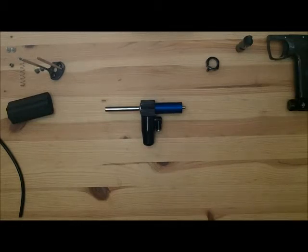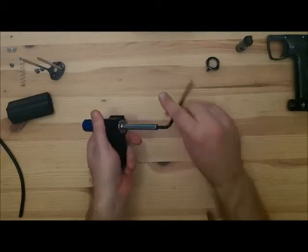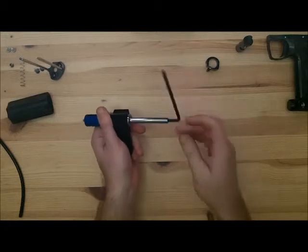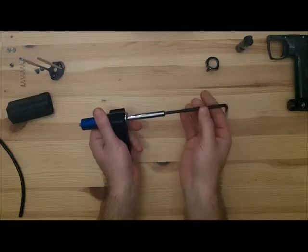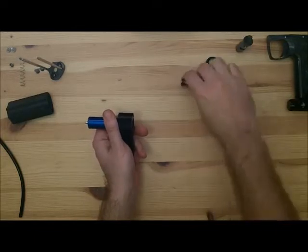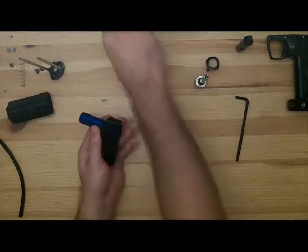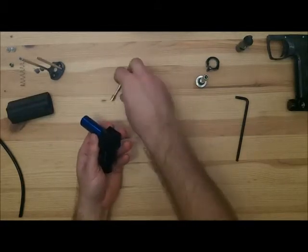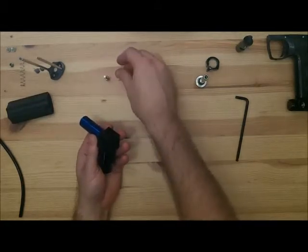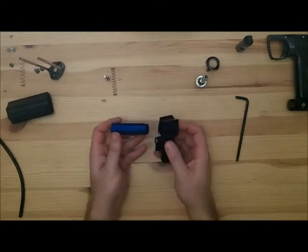In order to take that valve assembly apart, you need a 3/16 Allen key to take off this pump guide rod. Okay, it's got an O-ring, so set it aside. And then that's not what I wanted to do, but that's fine if that valve comes out. Valve pin, I should say, and return spring. And this sleeve comes out here.